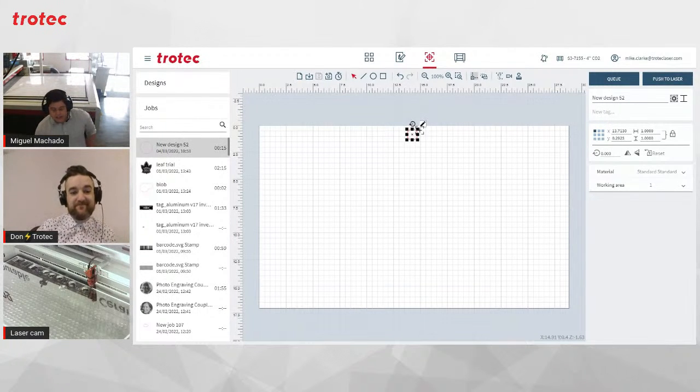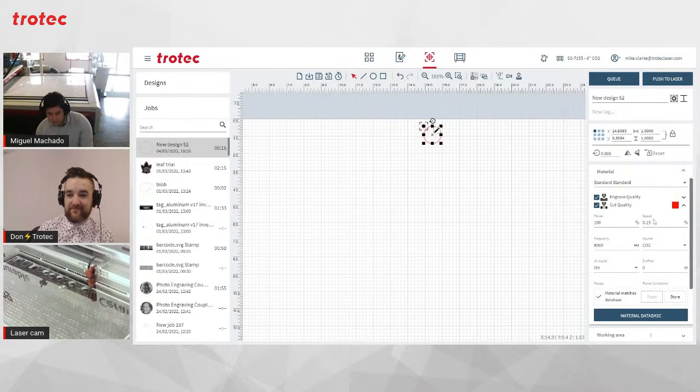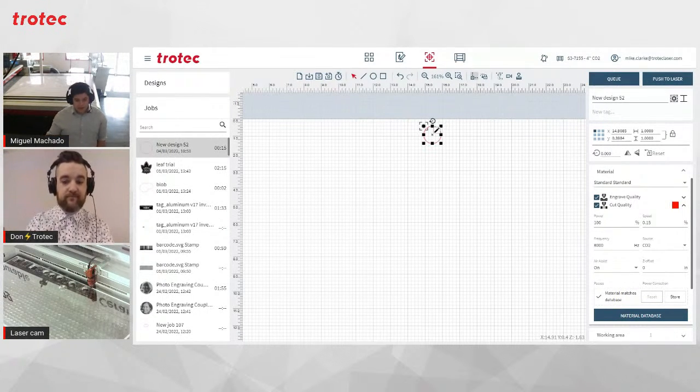It's not going to look that good. So I just chose a spot here in the laser where I want to cut this. And remember, this is not in the right focus. I offset it negatively. And I'm going to use this speed, so it's a very low speed, 0.15%. I think the quickest that I could do without using a 2.5-inch lens was 0.25 or something around there. That's what cut for me, but that didn't flame as much as I wanted. It did have reflections, but I wanted to actually catch fire.